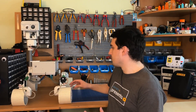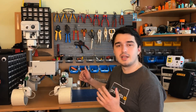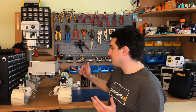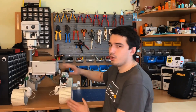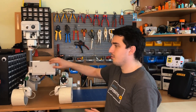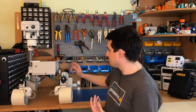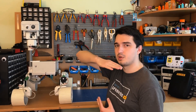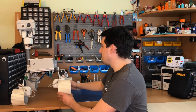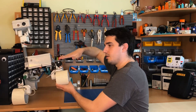The core component of the rover that actually inspired me to build it is the mechanical suspension, inspired by the NASA rovers. The NASA rovers use something called a rocker-bogey suspension. What it does is that if a wheel lifts 20 degrees, the body will only lift 10 degrees, so all angles affecting the body are halved. This rover works on the same principle but uses a differential underneath instead of a rocker, which actually allowed me to add a servo motor that can automatically adjust the level of the rover so it's always stable.